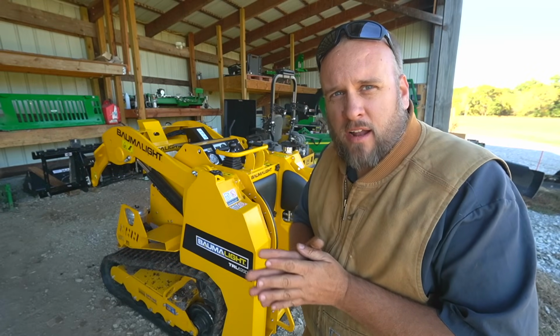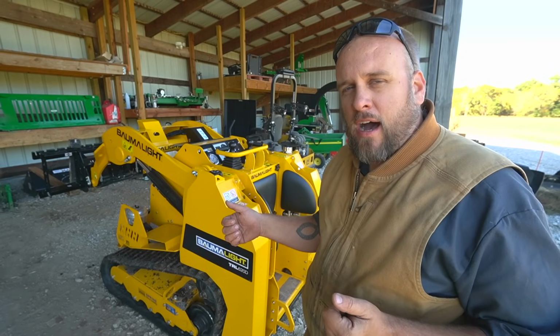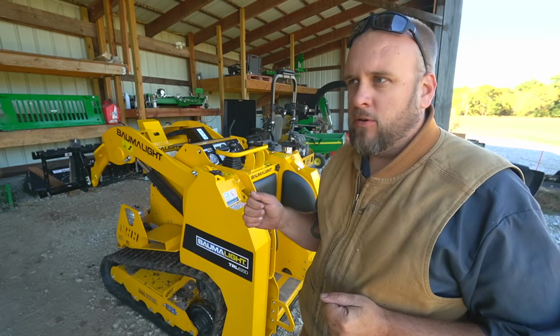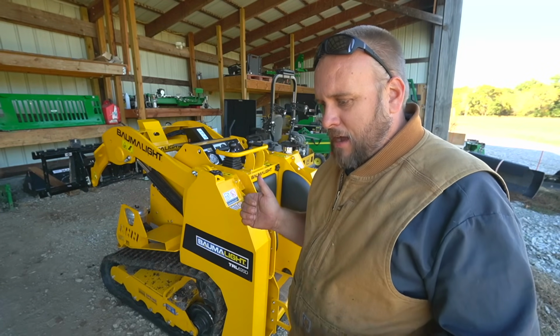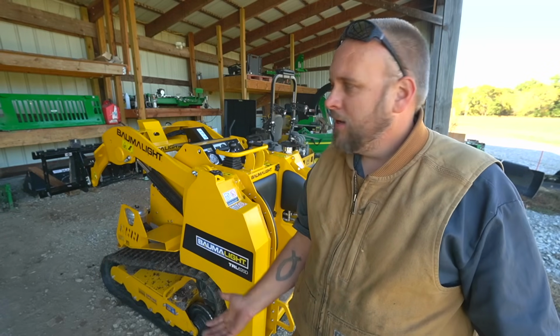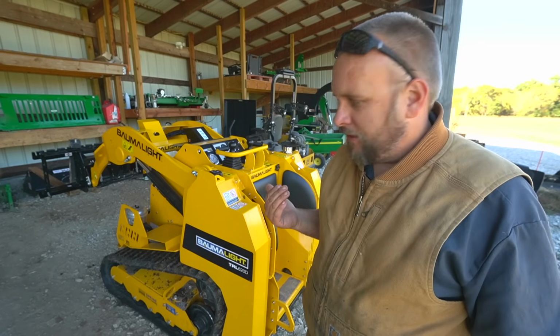So one thing you may not have been able to tell about the way it handled those totes is that I was not running out of power to lift the tote. I was easing into that handle and I would stop when I felt the machine starting to tip. The hydraulics could have continued to lift it, there's just not enough counterbalance.